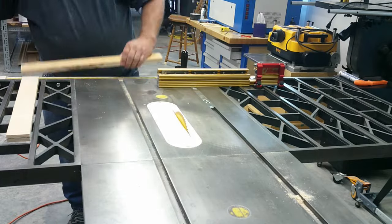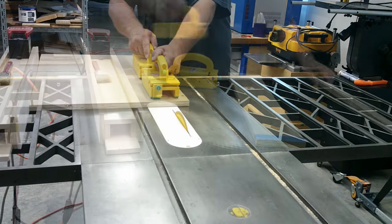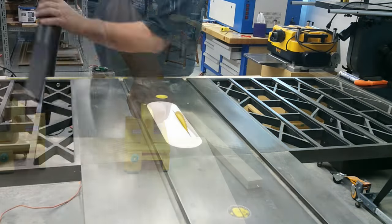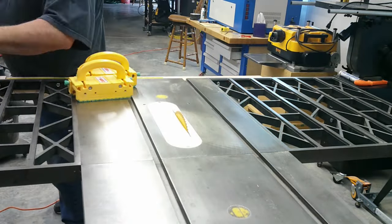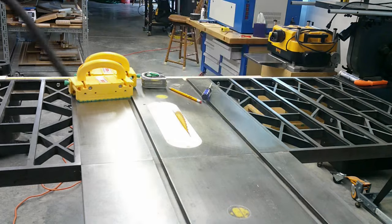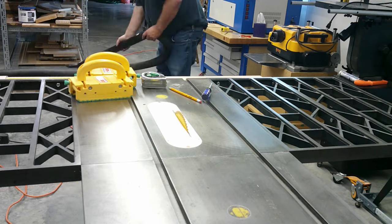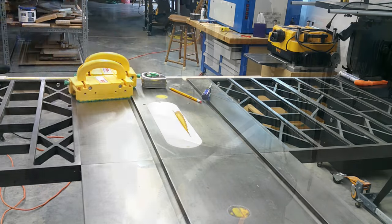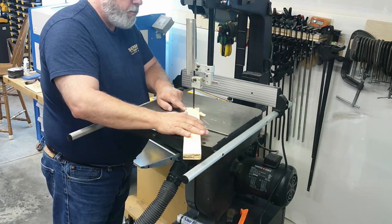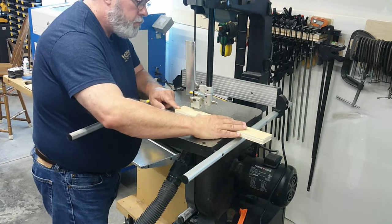The full sheet plywood cutting diagrams look to be good, but I didn't use them other than for dimensions because I was using scrap plywood of various sizes. The plans also come with building instructions which were good and included a few pictures. I would suggest that you study the plans carefully before you start to cut any plywood and utilize common table saw setups for cutting widths of the parts, which will make the job go smoother and faster with less errors.